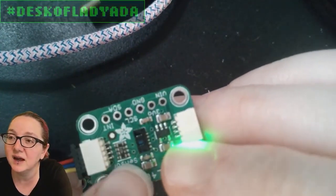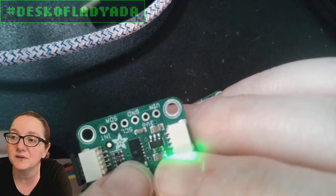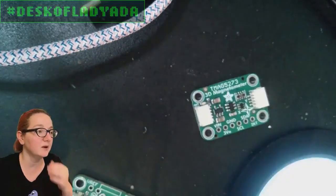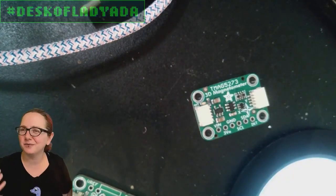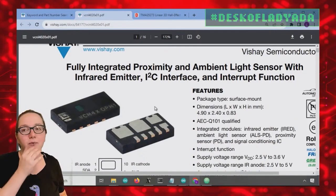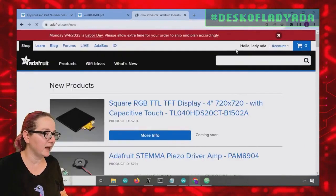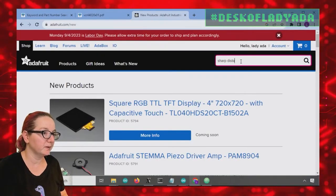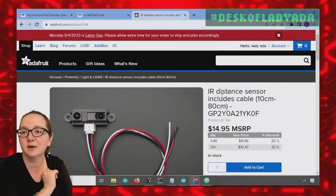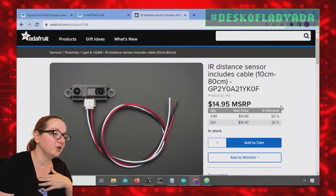You can see I have a little demo code running here that pulses — that's it doing a measurement. Every time you see that pulse, it's a measurement from that IR LED. And these are really great for doing distance measurement. It kind of reminded me that one of the first sensors I ever used as a youngling engineer was one of these Sharp GP2Y sensors.